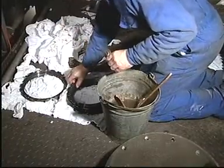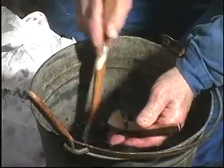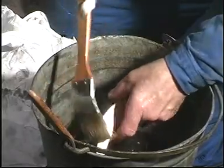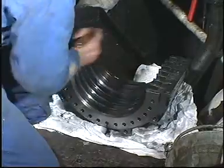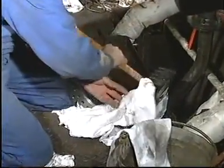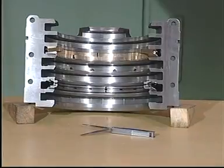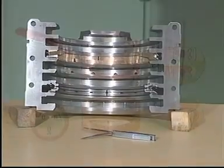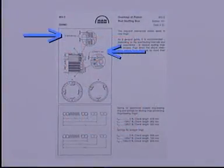Clean and inspect any segments which are to be used again. The stuffing box is so designed that it has the same time between overhauls as the piston. The lamellas are normally due for replacement at each overhaul, while the sealing rings normally only need to be replaced at every other overhaul. After cleaning, insert all segments in their respective grooves in the housing and measure the vertical clearance with a feeler gauge. See Instruction Book, Volume 2, Procedure 902.